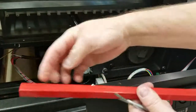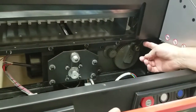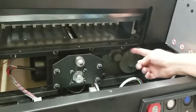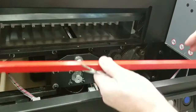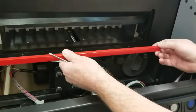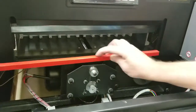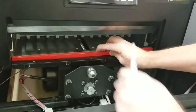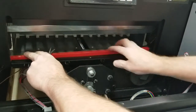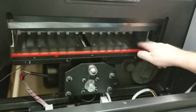If you've already used all four sides, just put in a new cut pad. Make sure your new cut pad is the same length — it can even be a hair shorter. When this bar comes around and forward to turn when you cut, if the pad is too long the bar will hit it and pop it up or push it down. When you put it back in, go all the way to the left to get it down in there, then go all the way over until it hits the side.